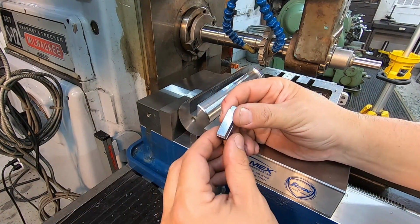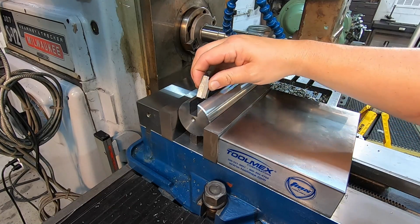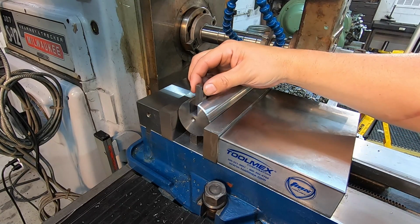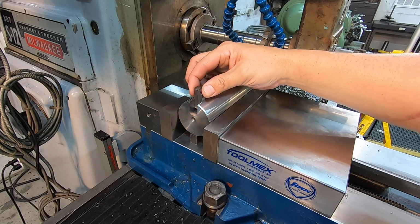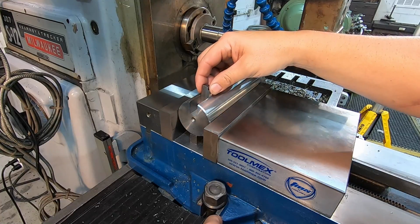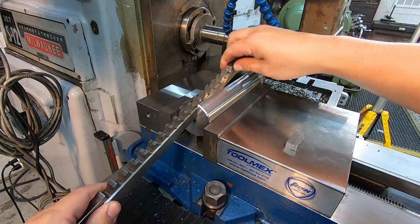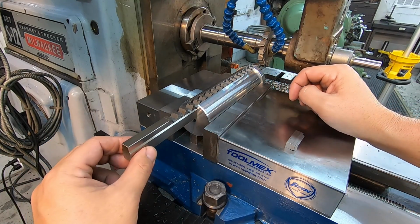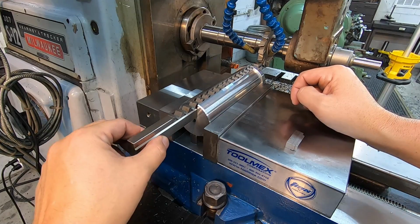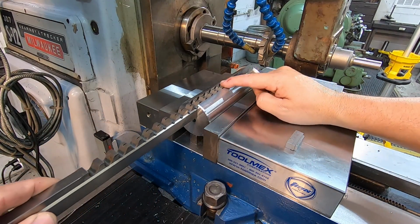All right, there's our 568 gauge block stack up. If I can get it started straight in there, there we go. So we got it fitting. It feels like it actually overshot it just a little bit. We may be 1/1000ths over that most likely, but here's our cutter. And our cutter fits in there just like it should. It's got perfect amount of clearance in there to broach that. So we should be on our depth right there.